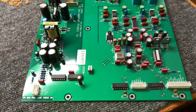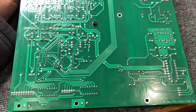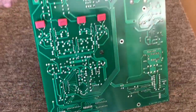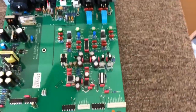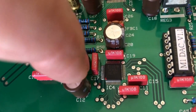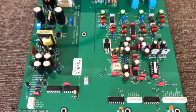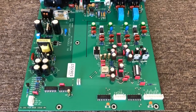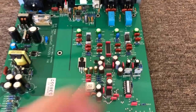The only thing I've got to do is take a few fingerprints off the top side and clean the bottom — just deflux that. Here is the board after a bit of a defluxing outside — it's come up pretty well. Not perfect, but a lot cleaner. For anyone following along, you may have noticed I had missed one cap — it's the little one right here. I had left that out, so I've just gone and soldered that in. Luckily I had literally one Wima left. I've used my entire stock of these tiniest 5mm lead-spacing film caps, all used in this job. I'm going to put this board back into the chassis and then hook it up and have a listen — fingers crossed it's going to sound good.